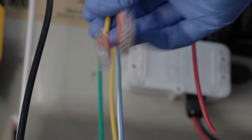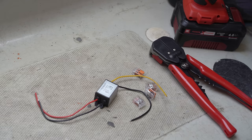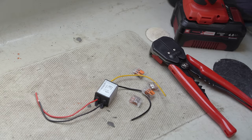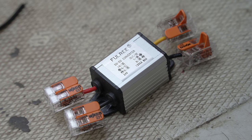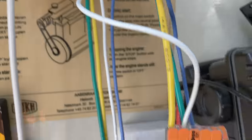Also, since I'm relying pretty heavily on WAGO connectors — which I like as they are small, adaptable, and don't need ferruled wire ends — I thought I'd use them on the converter before mounting it properly into the junction box. It means that if there are problems with any of the components, they can be swapped out without cutting, soldering, or re-crimping. Not suitable for all applications, but good here.